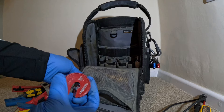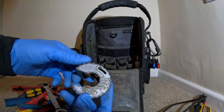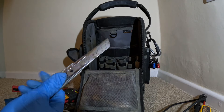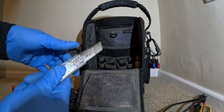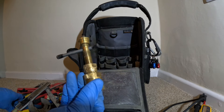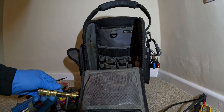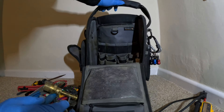That is the amount of tools you can fit just inside the bag, and we're still not even done yet. In the little zip at the front I keep a 10mm micro bore pipe slice. I've got the Ridgid two-in-one pipe slice that does 15mm and 22mm copper - a good bit of kit. I've got a snap blade telescopic knife - really good for pipe lagging, and cheap to replace when they break. Then also an olive puller - sometimes an olive cutter just doesn't work and you need one of these. It's got a quarter inch head so you can put it in an impact gun and drill off the nut without damaging the pipe.